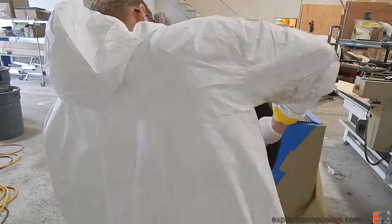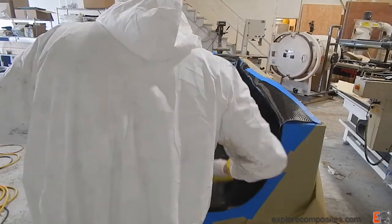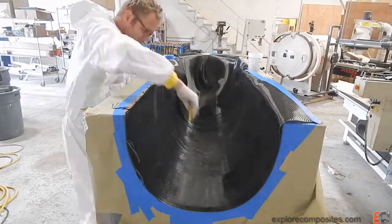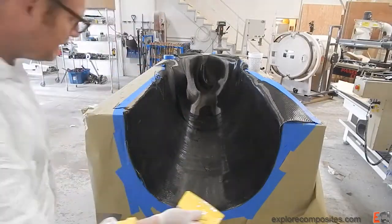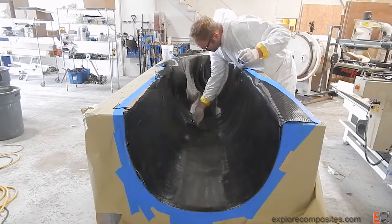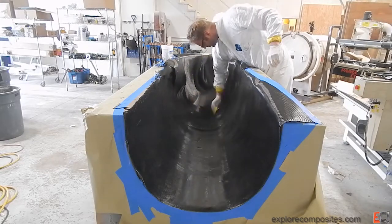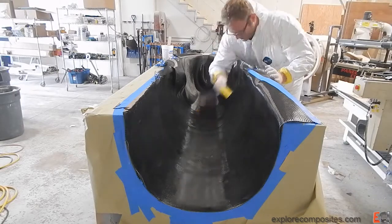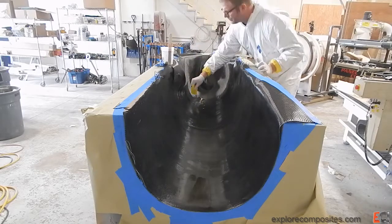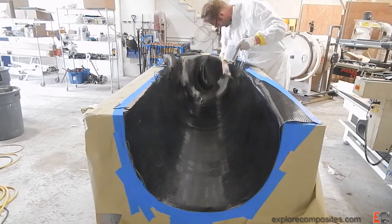This is probably enough resin, but I'm really making an effort to limit how much resin I use. There's a pretty basic process here, but you can get decent results compared to more expensive processes by being careful to limit the resin you use. It helps that this is a very simple laminate schedule and a simple shape. It takes a while — I think I'm using slow resin here just because it's a good hour of layup.